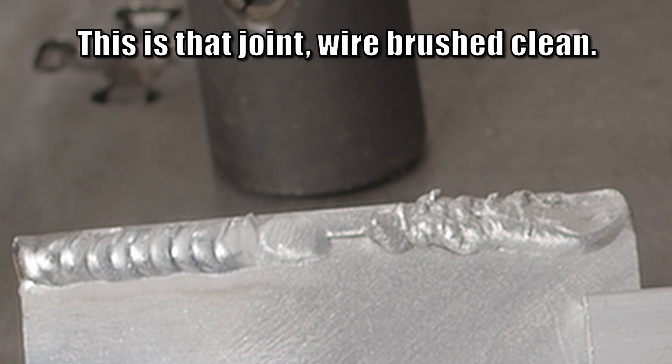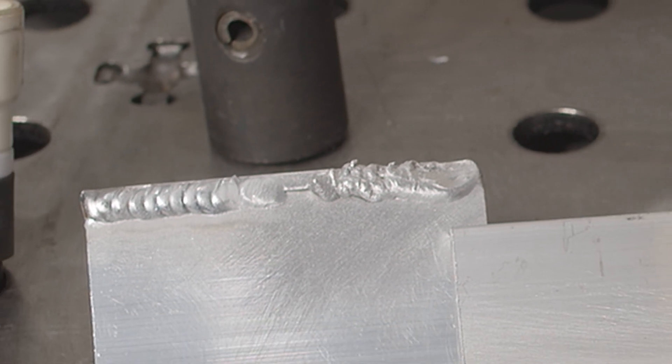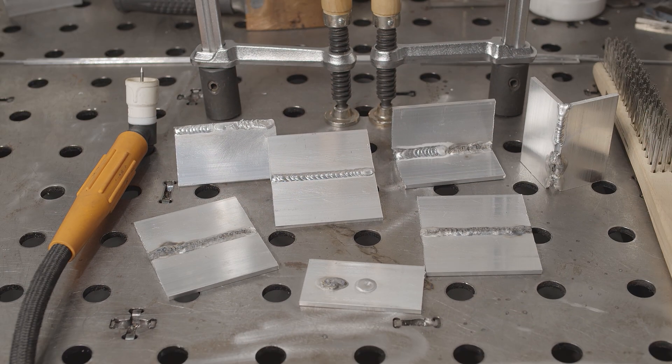However, there are downsides to using helium. Not the least of which is the simple fact that helium is expensive. Not only does it cost a lot more per cubic foot, but it also requires much higher flow rates for good shielding because it's so light. This means it is dramatically more expensive to run helium shielding gas compared to argon. Last I priced it, it would cost something like 10 times as much to run helium compared to argon, and helium has only been getting more expensive the last few years, so the price isn't likely to get any better.